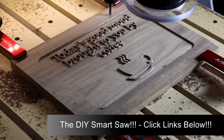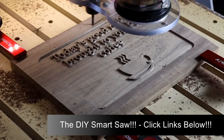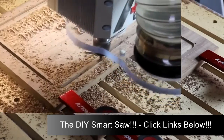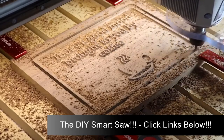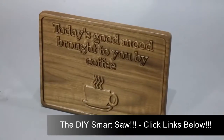Now we're back to that quarter inch cutter again in order to cut the final shape and dimensions of this sign, just like we did on the last one. When you see the spindle lift slightly, it's leaving tabs behind — bridges that connect the work to the surrounding frame to hold it in place. Same artwork, different tool path, and a different look.